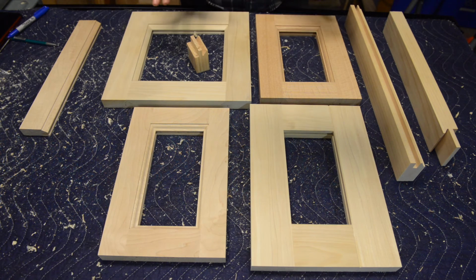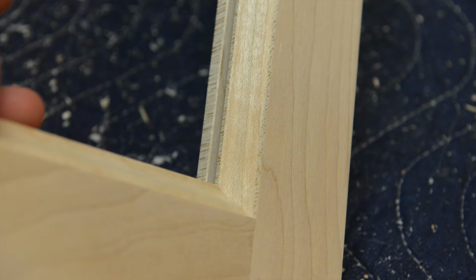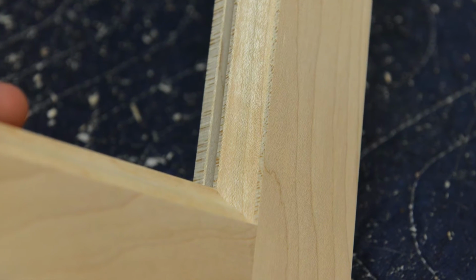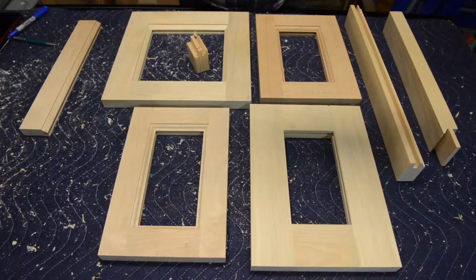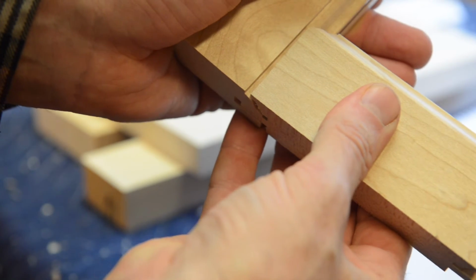Now the 6-inch diameter tooling left an excellent finish on everything I threw at it, including deliberately running some white oak as well as a couple pieces of sugar maple against the grain. The joinery is nice and snug as well, with the stock setup giving a nice sliding fit.